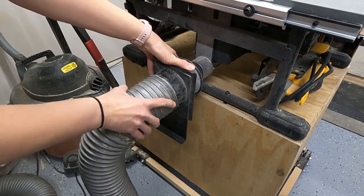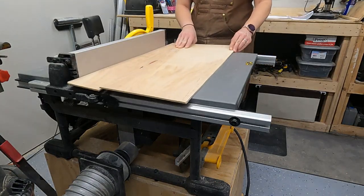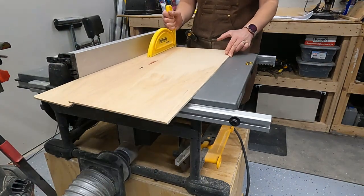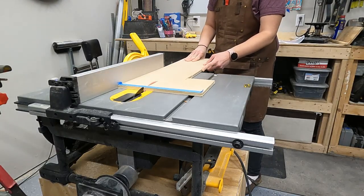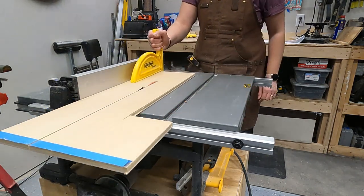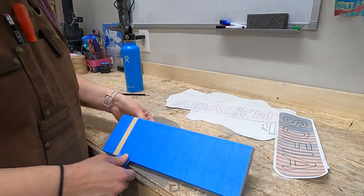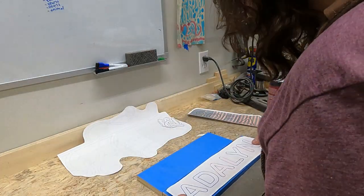Let's get to it. To begin, I ripped a quarter inch piece of birch and a half inch piece of birch on my table saw to four inches. I wanted the height on this puzzle to be three and a half inches, so I thought going with four inches would give me plenty of space to cut this on my scroll saw. After I ripped these to four inches, I taped my quarter inch piece and my half inch piece on top of each other. The quarter inch piece is going to be the bottom of our puzzle, so you want to make sure that is on the bottom of the stack and that the half inch piece is on top and your pattern gets glued to that.